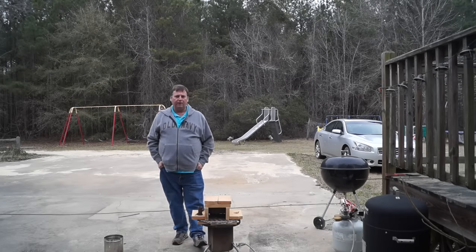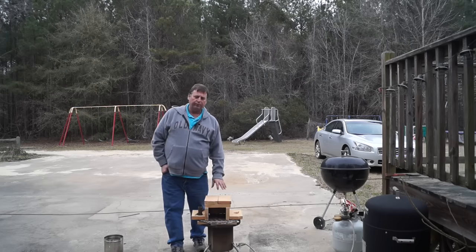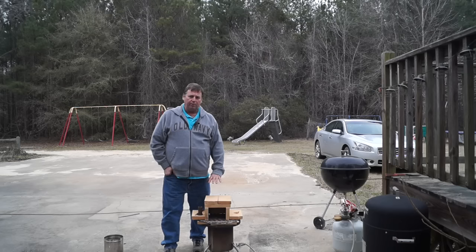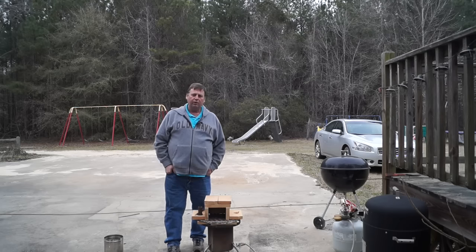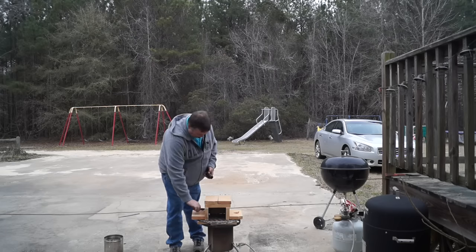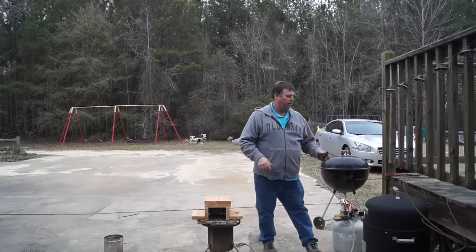Well, today we've moved outside to do the heat treat on the angles. And what we're going to use to heat treat with is this little scratch built oven here. Basically it's fire brick stacked up on top of a jet cooker I have, with a grate in there to hold the parts. It seems to work okay. I heat treated this tube here, and it's pretty hard. So I think we'll be all right using it.